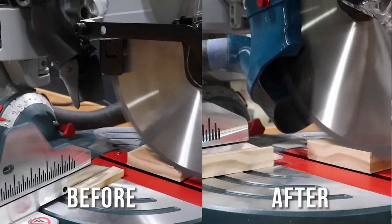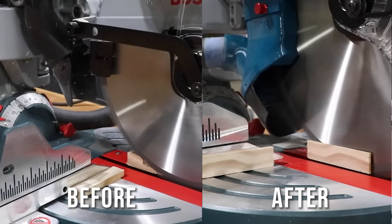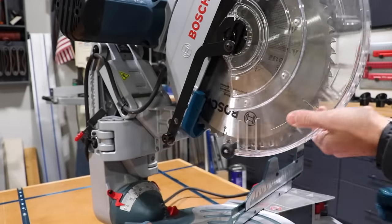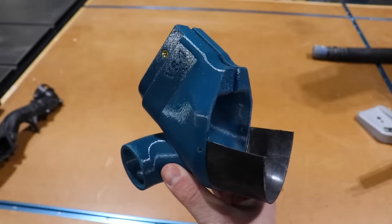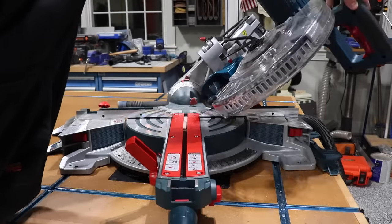In summary, I think this thing accomplishes what we set out to do. Number one: it significantly improves dust collection. Two: it is very well suited for 90-degree cuts. Three: it is fully capable of 45-degree bevel and miters, just not sliding bevels. Four: it is extremely easy to remove via the two thumb screws on each side. And finally, number five: the friction fit on the back makes adapters and different-size hose connections a breeze. For that reason, the larger version is the winner — you get a higher level of performance without sacrificing any capacity, except for sliding bevels.